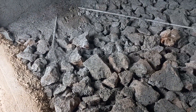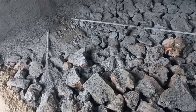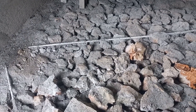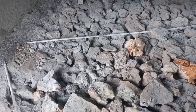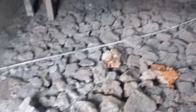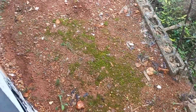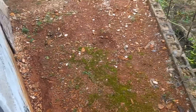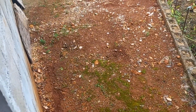These are just stones — this is not going anywhere no matter how long it's been here, because from the very first moment this started it's just stone inside. That's why we don't put any mesh here. But if you are casting on a floor level like this that is dirt with very few stones, after a while it might shrink, so you're going to need BRC wire.